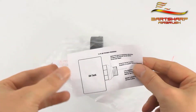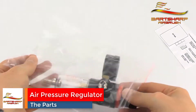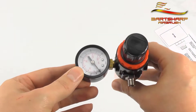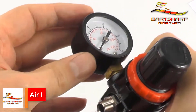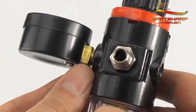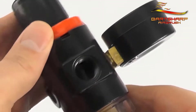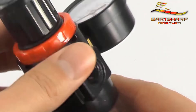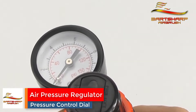This diagram I'm pulling out here I'll put up on the screen in a little while for a closer look. Let's get the pressure regulator out — it's also called a manometer, a water trap, and an air filter. Each should come with a pressure gauge that reads in PSI or bar. If your pressure gauge isn't pre-fitted, always use a spanner on that brass connector with a bit of PTFE tape. The air outlet is 1/8th BSP male, 9.35 millimetres in diameter. The air inlet is 1/4 BSP, about 11.75 millimetres in diameter — that's the part that fits to the air outlet on your compressor, and you'll need to use PTFE tape.